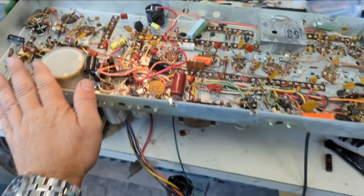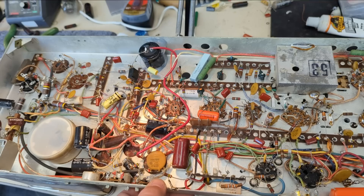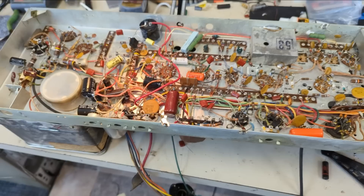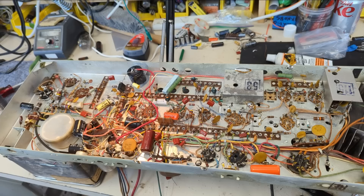I've got it on the bench at chest level, and it's a real shallow cabinet so everything was super easy to get at. There is one more issue: when I pulled the yoke connection off the chassis, one of the wires was loose — the red wire, probably meaning it's pretty critical. I need to do a sanity check to see where that goes, find a schematic, or consult one of the guys who are a lot smarter than me who volunteer here.